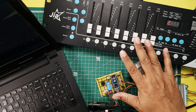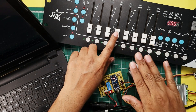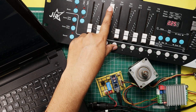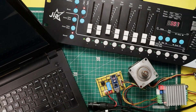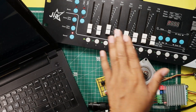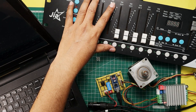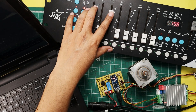We are going to put a projector on this stepper motor to rotate it. We will give a DMX value to this fixture and as per the value the projector will rotate. We will put multiple screens all around the projector and by changing the DMX value we will be able to rotate the projector and project the video on the desired screen as required. So here is the project where we have made a fixture to change the stepper motor angle by changing the DMX value.